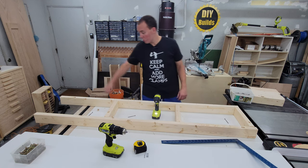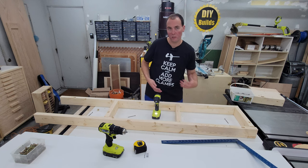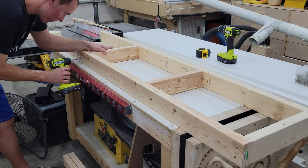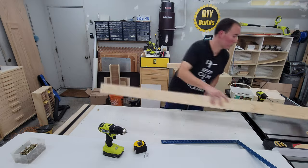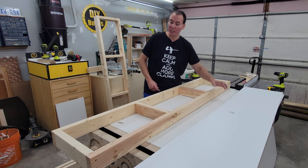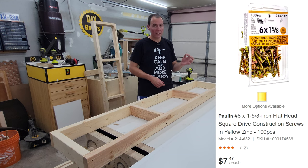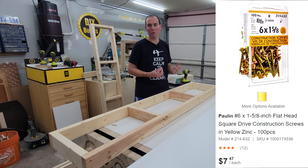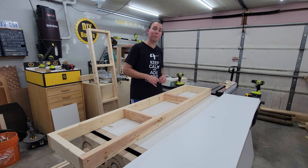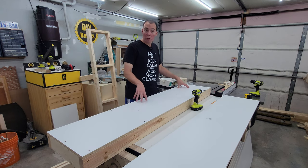I'm not going to be putting the board on either side — I'm actually just going to visually line it up somewhere in the center, the same way as if you were framing a wall. Now that we have the frame, time to put the top skin of the shelf on, which is our 5/8 inch melamine. It does have edge banding on the front, and we're going to be attaching it with 1-5/8 inch screws, putting them in about every foot or so. And there we have it — let's do this two more times.